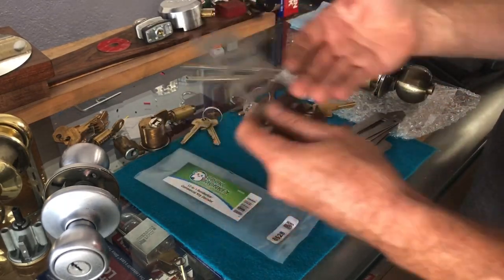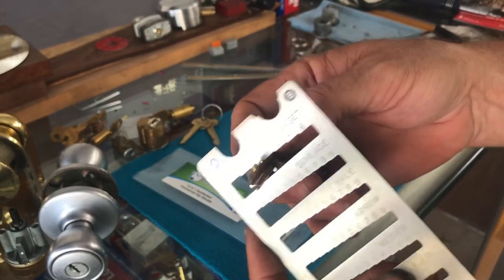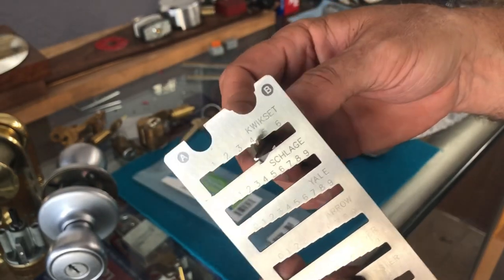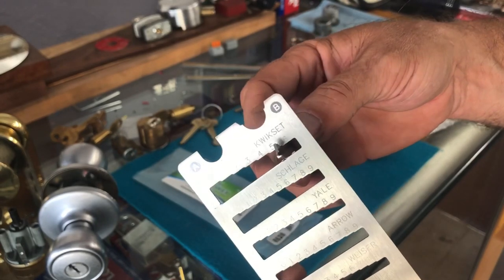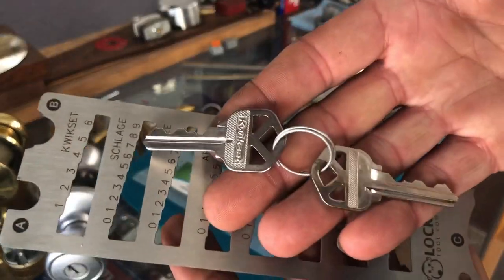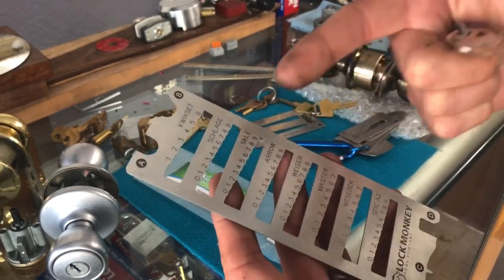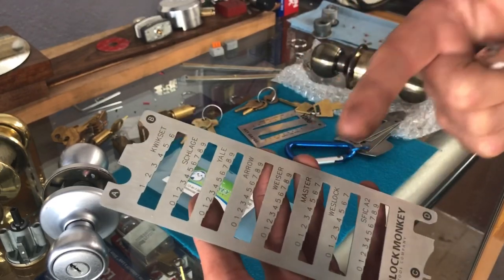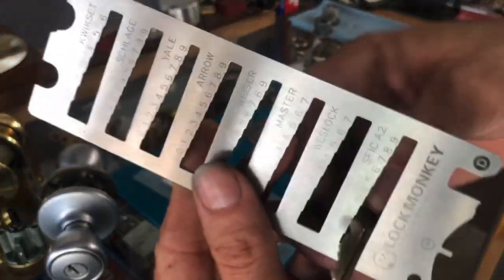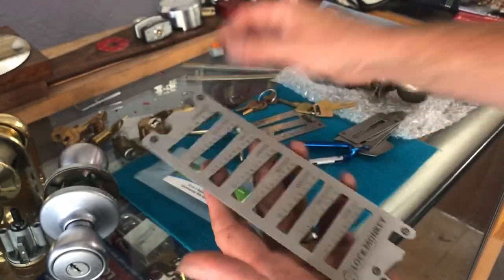Three different clip removal tools, and this is probably just a keychain hole so you can hang it up. With positive stops — the staircase style — you just run the key down until it stops and you know where it lands. With common keyways you pretty much know the cuts without a gauge after a while, but it's handy having the oddballs like Yale, Arrow, Master padlock, Westlock, Schlage, Best IC, and an A2-style IC core all in one place.